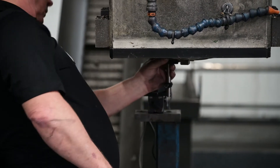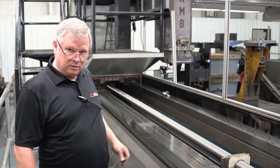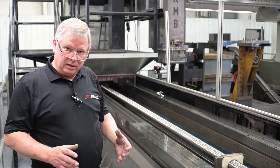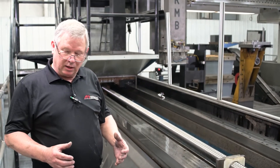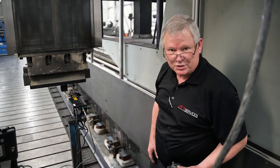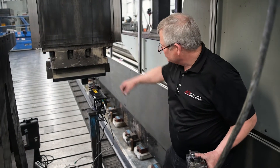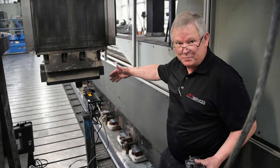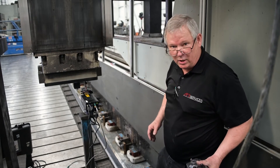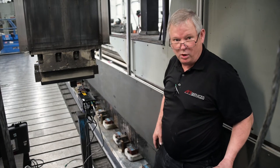I've got a hand pendant on the back side of the machine and we're going to hand move the machine to get the sensor in the right position in line with the XD laser before we start our buck-in process. You can see our sensor and the red laser dot off to the side — the XD laser is still warming up, but it's enough for me to start the process. By the time I get done with the process the XD laser should be completely warm and ready to start our measurement.